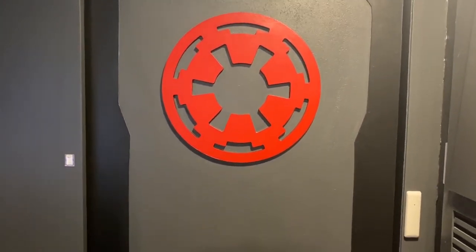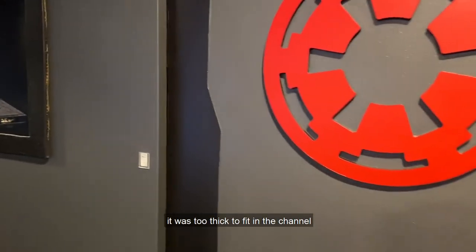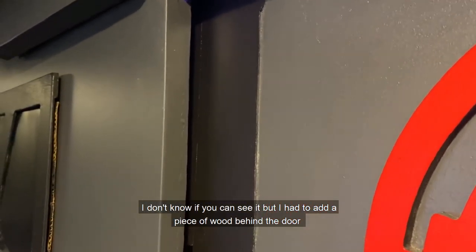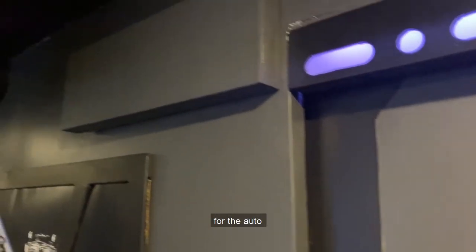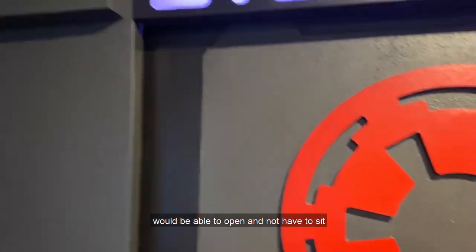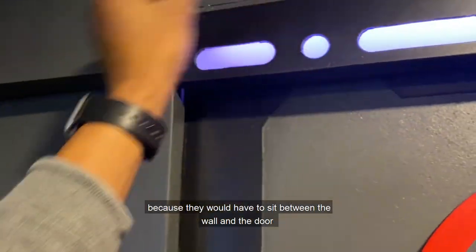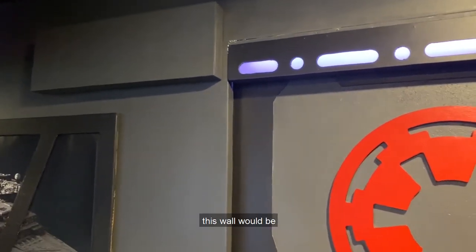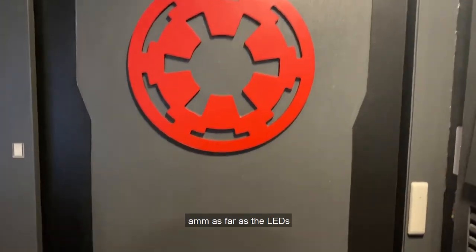The original door was just a regular hollow core swing-out door — it was too thick to fit in the channel with the motor and everything working. I had to add a piece of wood behind the door so the gear for the auto opener would work without sitting in the space between the wall and the door, because then I wouldn't have a stud there and that wall would be pretty flimsy without that main stud.